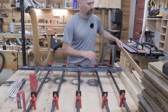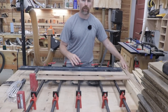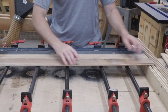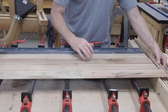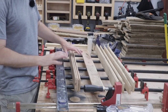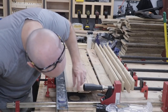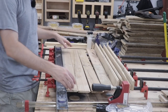I've got a tongue and groove on all the boards that I want to glue up, so I've got my clamps all laid out and I'm going to start orienting the boards to the position I want to glue them up in. I've also got my four-foot carpenter's level that I'm going to use as a straight edge, because as I start tightening the boards together, I don't want them to warp at all. As I lay the boards out, I want to make sure the grain is alternating — I don't want all the grain turned the same direction. That's one of the reasons I like to lay it out first before I glue it up. The grain going in different directions will keep the panels from wanting to bow.